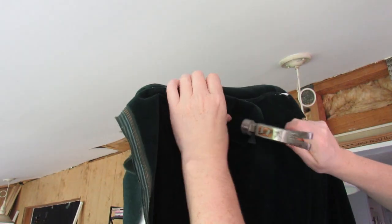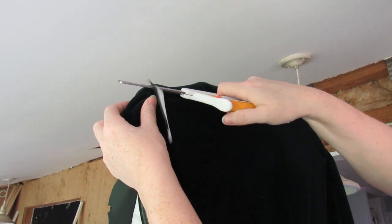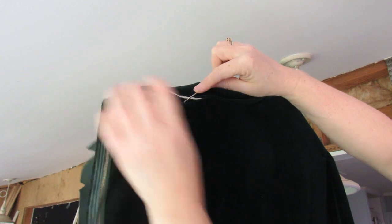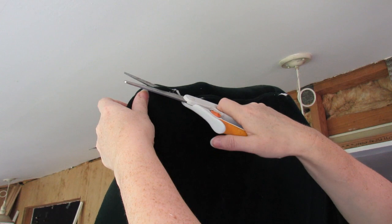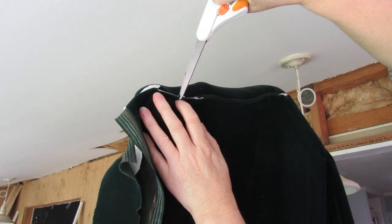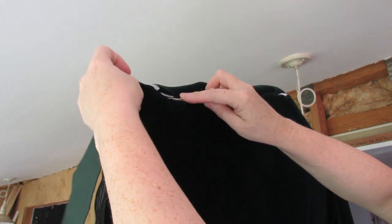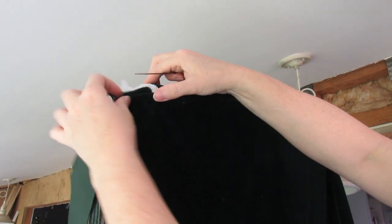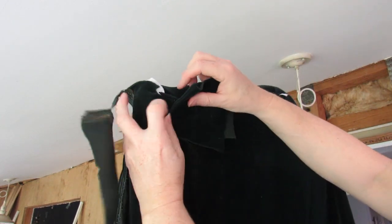Here again I have to cut down and up — just pop it in. It looks like I can trim that out a bit more — be careful you don't cut the piping. I have done that before and had to start all over again. If you want to, because it's a little bit more of a cut, you can trim like you did — just make sure that it all goes in. I'm not going to bang down this last part because I might have to alter that, but I will pull that out and tap that into place.